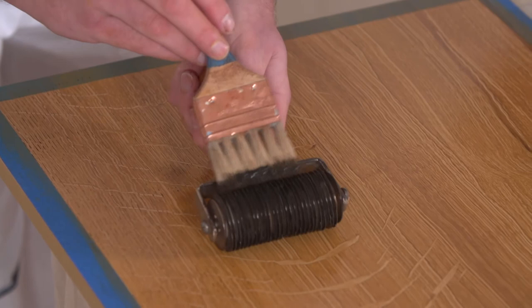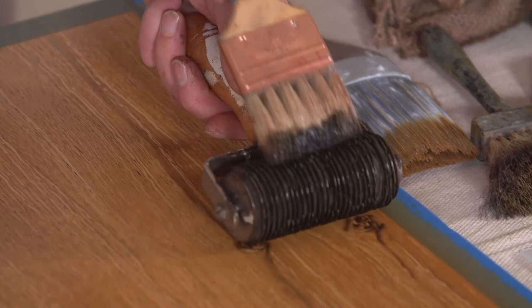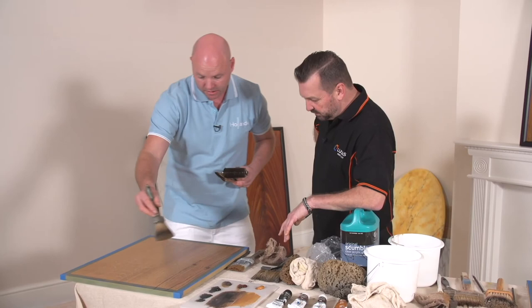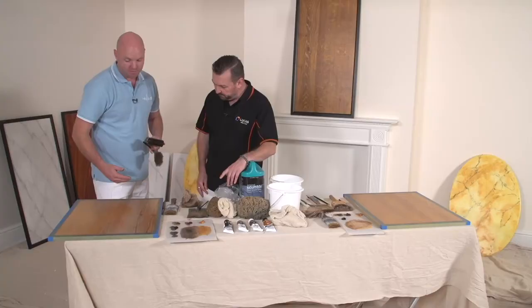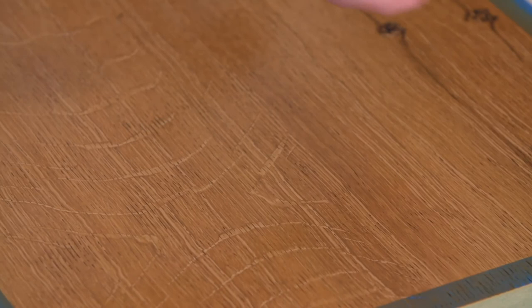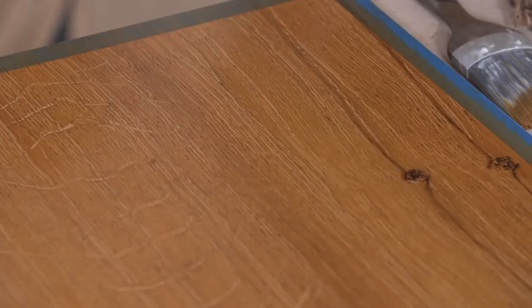I'll just do a few more, loading up the roller as I go. So this is a very basic, simple way of creating an oak effect. Now that it's on the surface, we always go with the grain — we drag those dark lines with the grain. That gives us a good realistic basic wood grain effect of quartered oak and also a straight grain oak with a couple of knots to create that realistic look. Looks fantastic — so that's our interpretation of imitation oak.